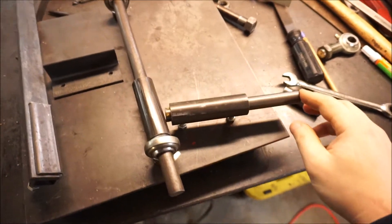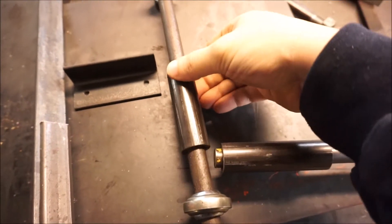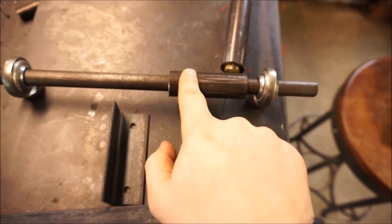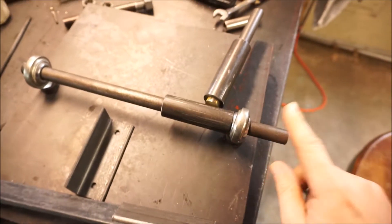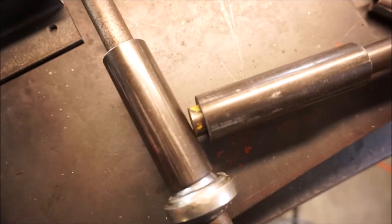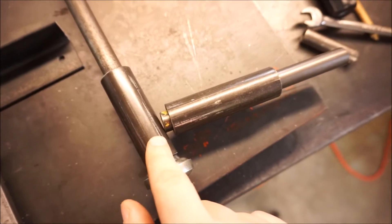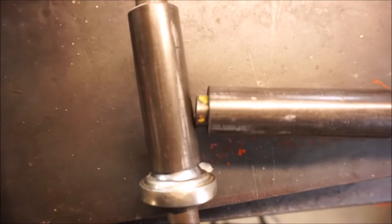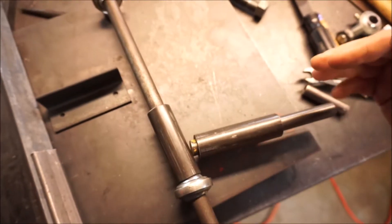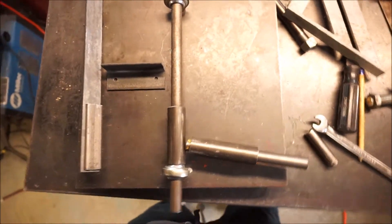This is what we've got so far for the jig I'm going to be making the spindles on. This is the barrel piece — this is what the kingpin is going to actually be on, and I'm going to weld it to the kingpin eventually. This piece of shaft is just for the jig. I'm going to weld this 5/8 chromoly onto this barrel for mocking purposes only. As you can see, this is at an angle — 10 degrees — and that angle is called kingpin inclination.